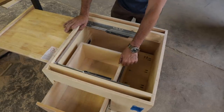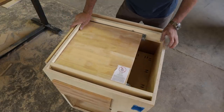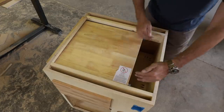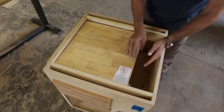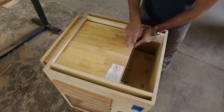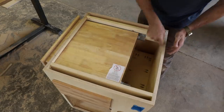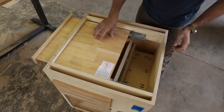This was one of the first drawers that I built — it's got a large drawer here. The tricky part was I decided to go ahead and put a sink in here. I found a tiny little stainless steel bar sink, about 14 inches by eight and three-quarters inches, that will fit right here. I'm going to have to cut off about an inch and a half, but it'll fit. I left enough room for the drain to go out the back.